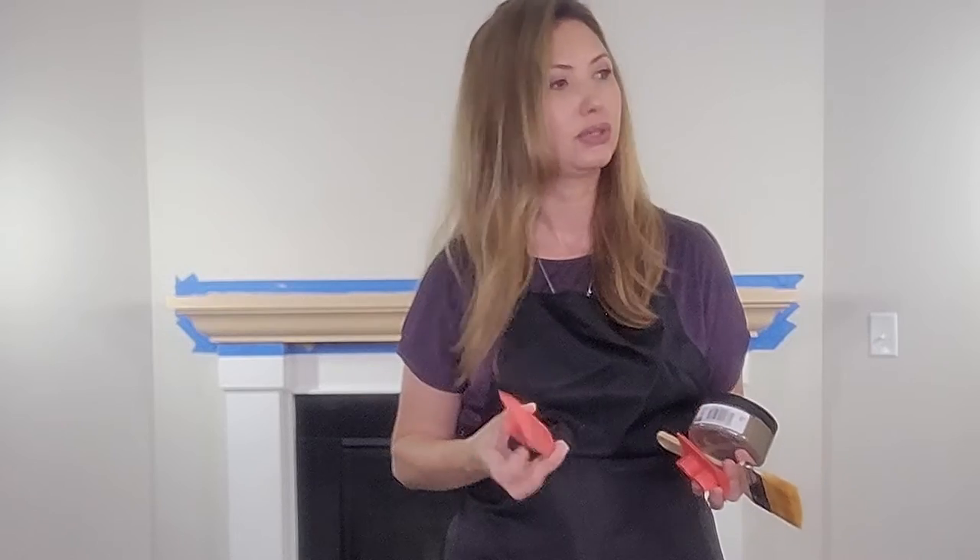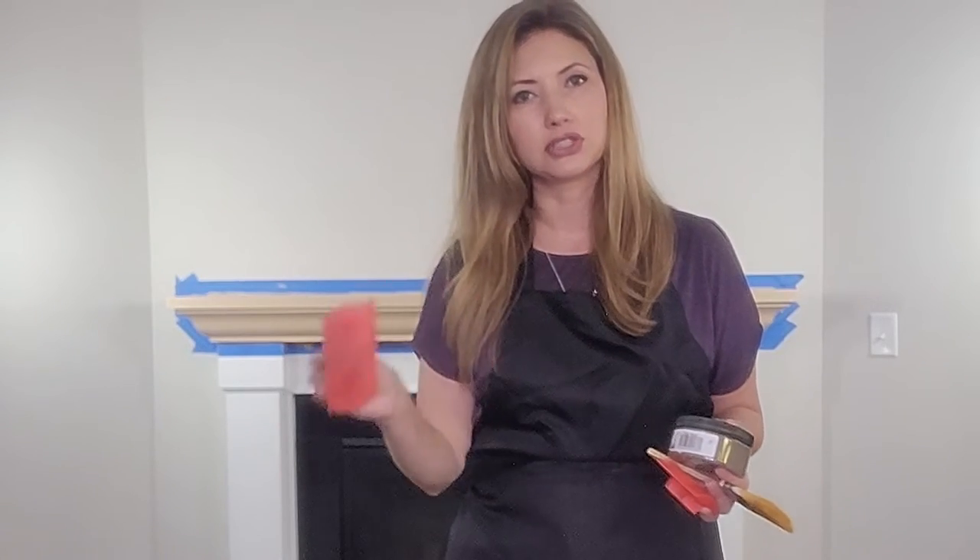With the smaller one, you can go around edges very nicely. Graining really only takes just a couple minutes of trial and error. You can actually do a sample piece — take an old tile, an old piece of wood, or even an MDF board — and test out different looks to make sure it's the look that you want.